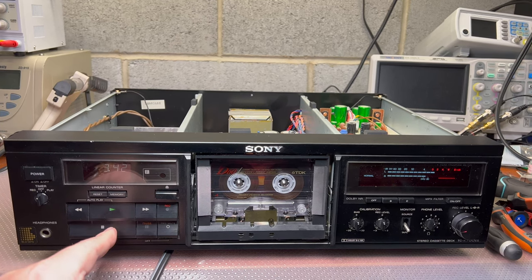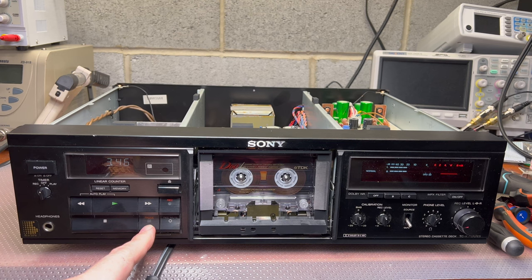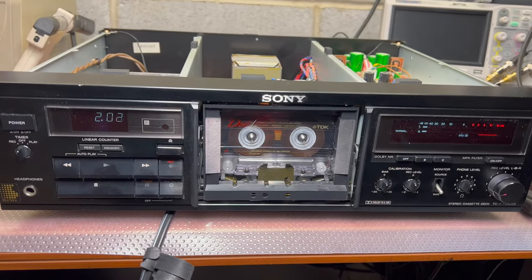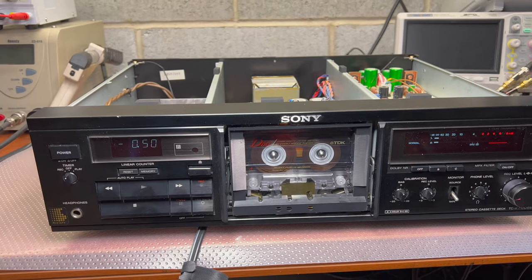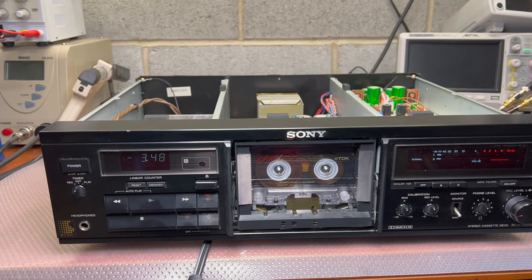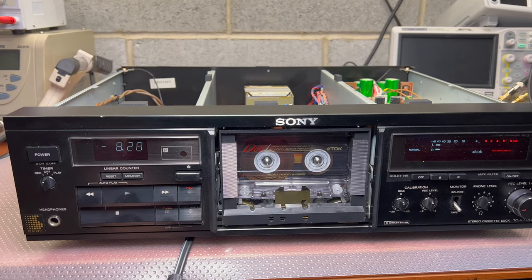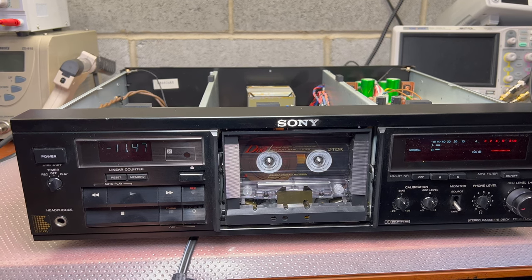You see, it works fine. Now it works fine. Okay. Good to know. It looks like there is a pulse, which is just barely enough to get into position. So it doesn't make it longer, but as you may see, the fast forward and rewind work pretty well now. It keeps to the very end of the tape. That was our goal, to make sure that our tape transport will perform smoothly.